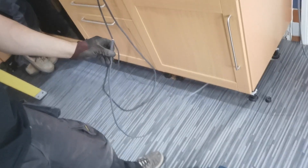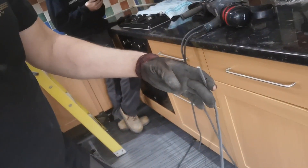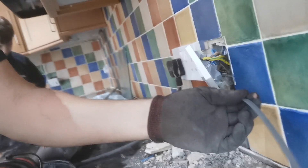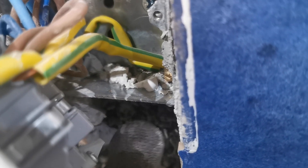So we've got this cable in now - that's ready, just hanging out at the bottom for the plinth line connection. We'll just leave it down there and won't cap it off, because what we're going to do is just coil it in the back of this switch here. So we just need to get it on front-facing mode - get this knockout out, put a grommet in there, get the cable in, coil it up, and that's done.